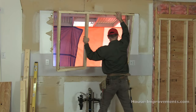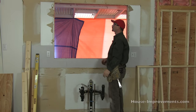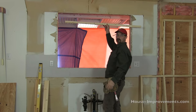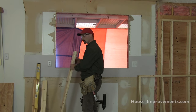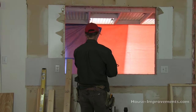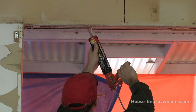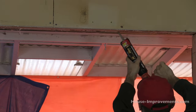I'm going to pull this down and set it to the side for right now. The first thing I'm going to do is install a piece across the top of the opening — that's going to go right to the bottom of the header all the way across. Before I do that I want to seal between where the new material goes to the old material just to stop any drafts. So I'll put a bead of caulking up here out near the perimeter, and then I'll put that piece in place.